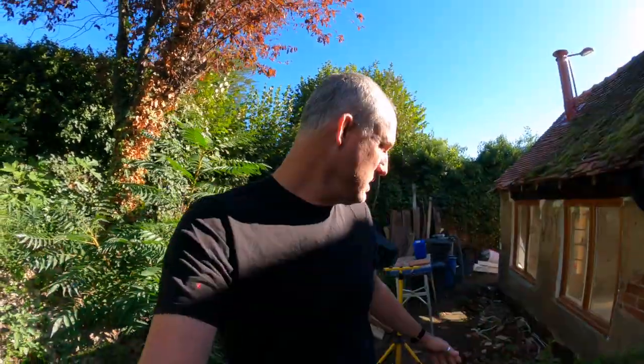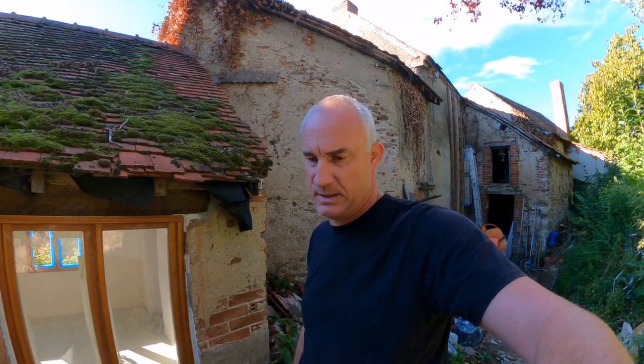Not a glossy tile, because you know it's an old barn. We don't try to convert it into a ballroom. It's gotta be a cottage feel. So we ordered these tomettes, and we also got a product that sort of seals the surface and makes it a little bit more dirt resistant. And that is the first thing I'm going to do when they arrive here. I will treat them. I'm not going to install them first and then treat the whole. I'm going to treat them one by one first, because I really don't want to have any cement stains or grouting stains on them.